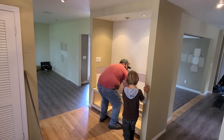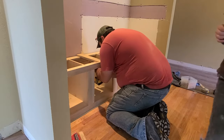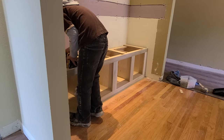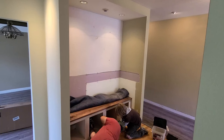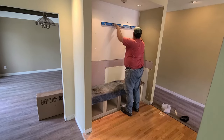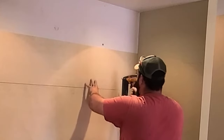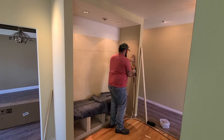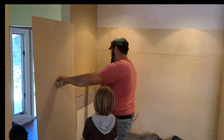With the watchful eye of the foreman, I managed to get the unit in place, leveled it out, and shimmed it along the back wall before attaching it with screws. The foreman decided I wasn't working fast enough and cut all the shims himself. After carefully setting the bench top in place, I secured it from underneath using screws. Then I figured out the height for the back panels, made a mark, used a level to draw a line, and installed the back panels in two sections secured with brad nails — only under where the battens would go. On the side panels I used one piece per side; the right went in with no obstacles, but on the left I had to cut a hole for the light switches.